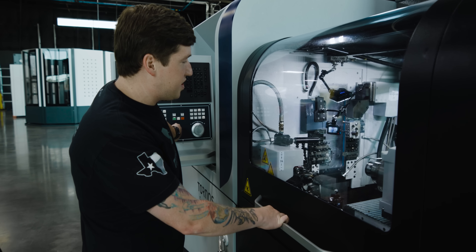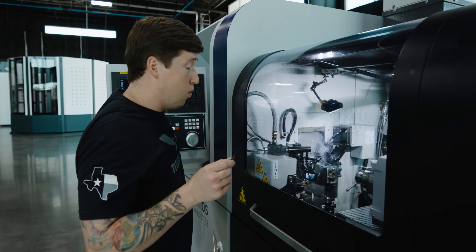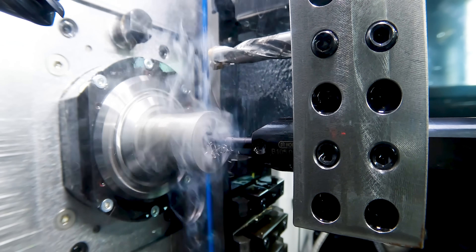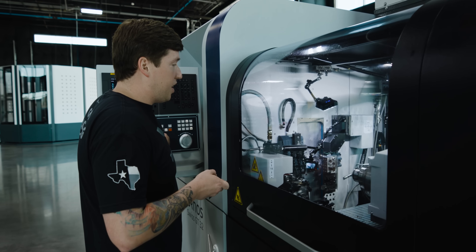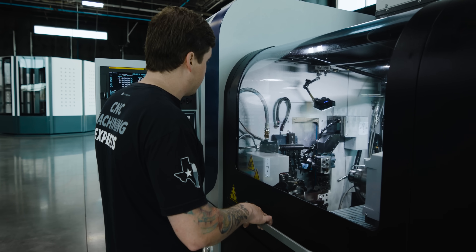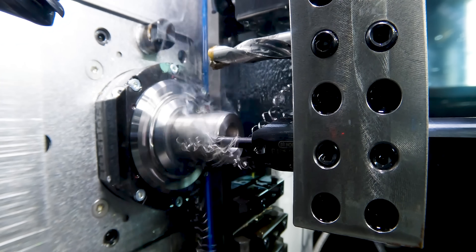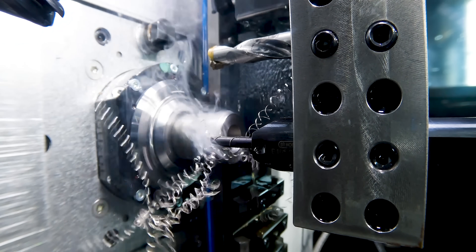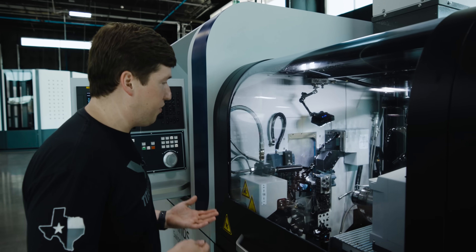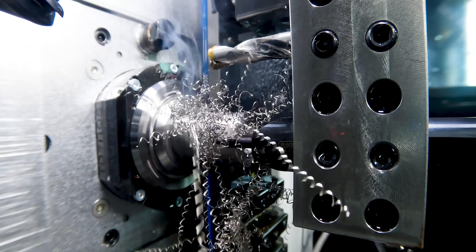I do want to say before we get into this — 303 stainless isn't really the worst material to break a chip on, but that's not the point. The whole point is to see if just by throwing this tool in there, will it or will it not break the chip? This should generate a little bit of a stringy chip. Why is this important? Why should you care? Because stringy chips like that, if you're running production, could easily wrap around tools, break sub-collets, break all sorts of stuff. That right there can be a pretty big problem. Imagine if I ran this a thousand times and wasn't by the machine — you'd have to constantly stop and do something about those chips. Not everyone has all these fancy options to break a chip or get chips off the tool.